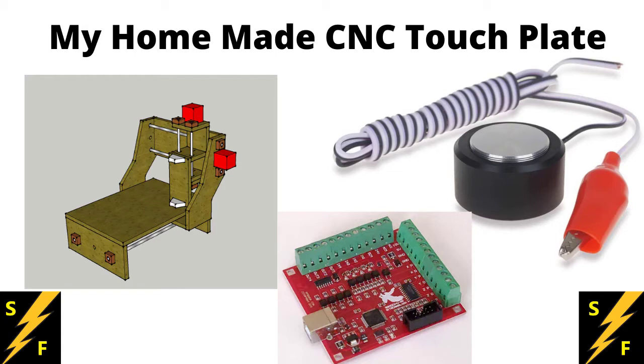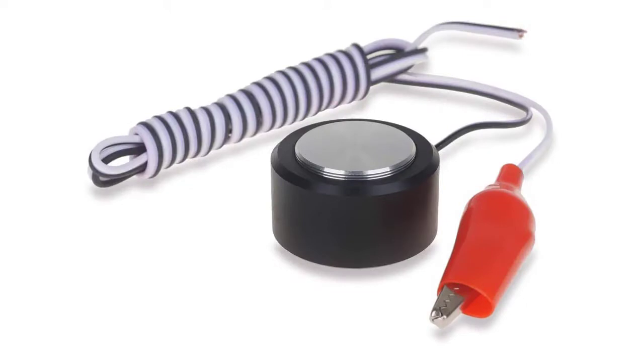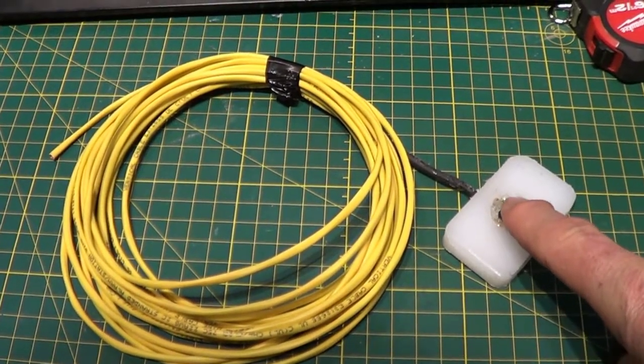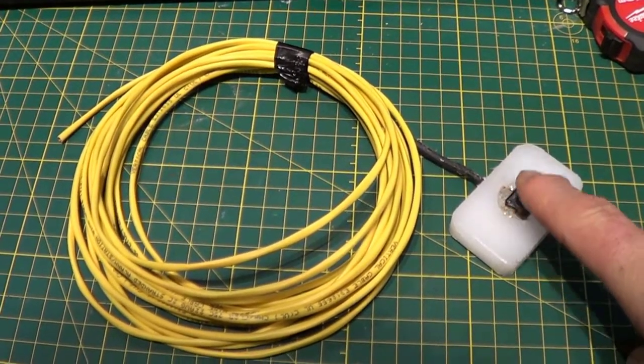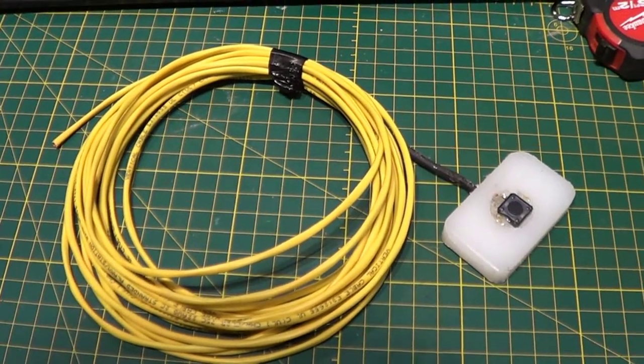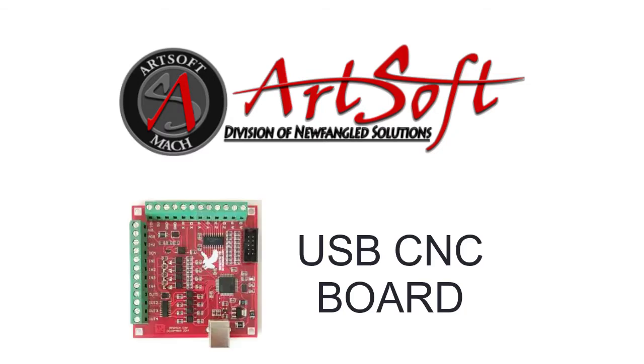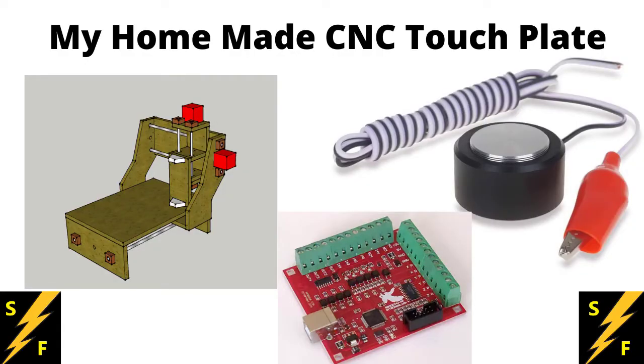There are commercial ones like the image above, with the little red alligator clip that you clip to the lead. I hate those. I want a little plate with a built-in switch. The bit comes down, clicks the switch, and you're done. No alligator clips, no mucking around with your bit. All automatic, all running a script within Mach 3 using a USB CNC card. So if this sounds interesting to you, follow me along as I try to make a CNC touch plate out in the garage.